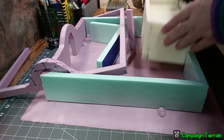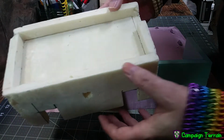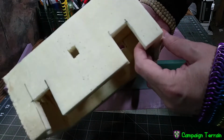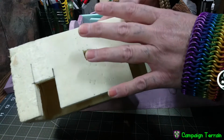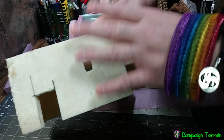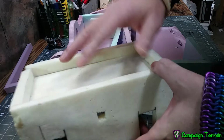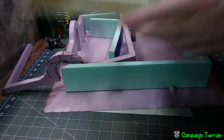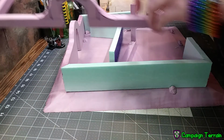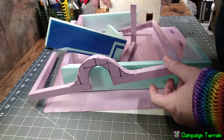The PIR foam, that's the other type of insulation that I started with the house. Do not sand this. You do not want this chemical anywhere near your lungs. You don't want it stuck on your hands, anything. And it's already got a kind of rough texture that'll hold the paint anyway. There's no need to. So if you're using the PIR, don't sand it. Leave it alone.